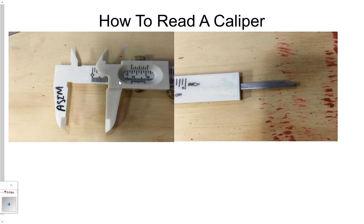I want you to look at a couple things. There are three different measurements we can take off of a vernier caliper like this one. One of the things we can measure is the inside — those are the inside jaws. We can measure the outside diameter of something, of course including rectangular blocks or anything else. The jaws up at the top are usually for measuring the inside diameter of an object. On the back, you'll notice a piece of metal that protrudes out of the base, and we can actually use that to measure depth.